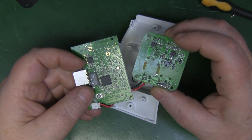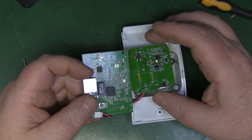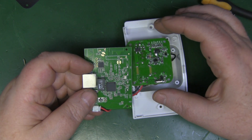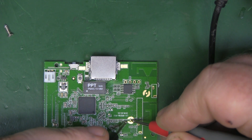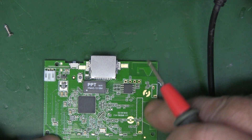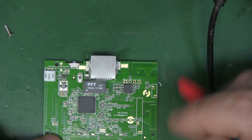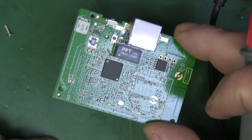Look for a repeater that you provide your own power supply for, so you can buy from an established retailer and use your own supply. Because the repeater board itself — there's nothing wrong with it at all. The quality of this far outweighs the quality of the power supply. I hope you enjoyed this five-minute autopsy. Any questions or comments, drop them below. And in case you were wondering, the test pads are active, so it would be very easy to modify this board, remove these antennas, and add your own bulkhead SMA connectors. I'll definitely keep this — maybe I can use it in a future project.